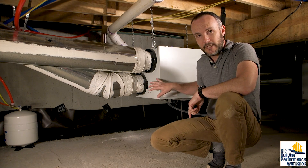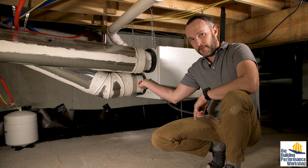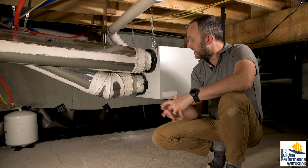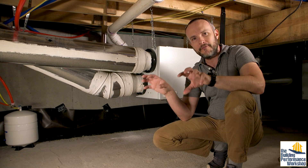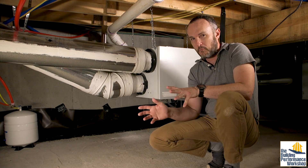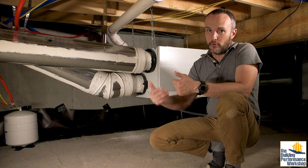On a Fantec model, you adjust this simply by dialing down the dampers right here. In some models there are different versions — you can change the power going to each of the fans and dial the fans up and down themselves. In these cases, though, the standard way has been to dial down a damper to limit the fan's ability to move air.